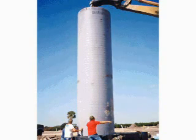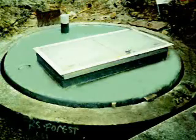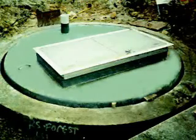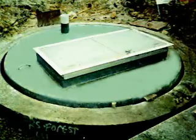Normally, the wet well liner is six inches smaller than the old wet well. Place the fiberglass liner in the center of the old wet well and pour concrete grout into the annular space between the two wet well walls, and replace the top of the wet well.